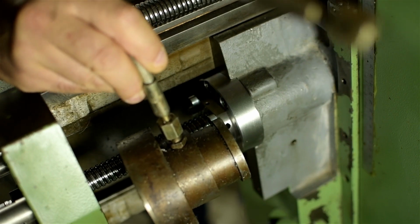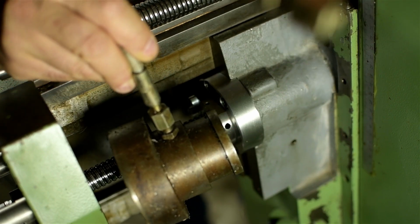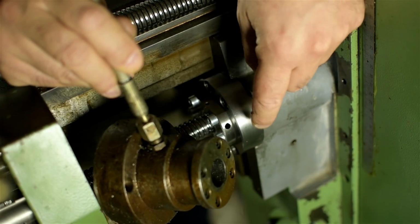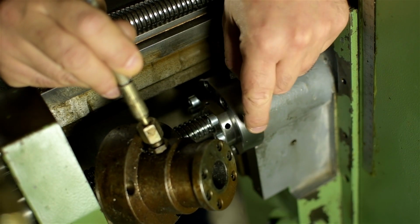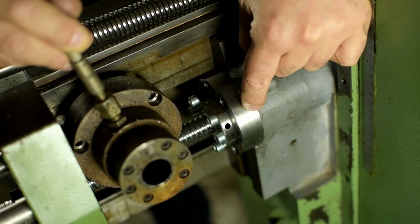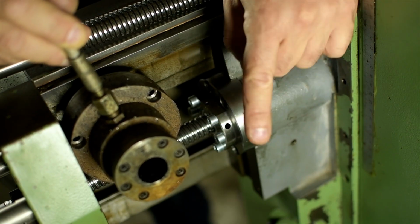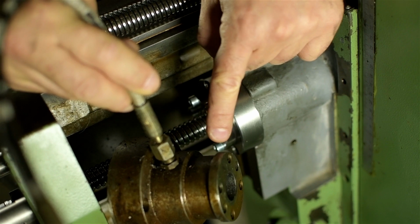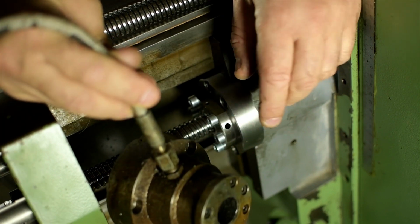You remember this thing? The hydraulic locks I went on and on about a couple of videos ago? Well, I'm not using these anymore. So I had a big gaping chasm in this side of the casting that was ripe for taking advantage of. I figured I could just make a big bushing, like the one you're seeing here, and install the ball nut in that. When I got to wondering, hey, could I just modify the old hydraulic brake? Use that as my bushing? Turns out I could.